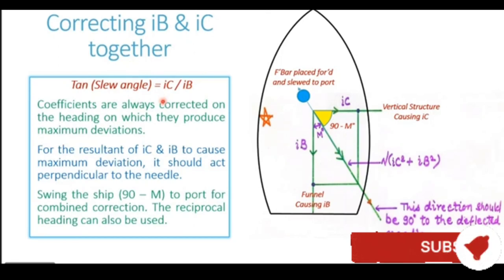the Flinders bar. Now the Flinders bar has to be placed in a direction which is opposite to the resultant of these two forces. So opposite to the resultant, we place the Flinders bar somewhere here in this direction. The magnitude of the Flinders bar, or the length of the Flinders bar, is decided by the magnitude of the resultant, and the slew angle is this angle M, which we have calculated using the formula tan of slew angle is equal to IC upon IB. So is it clear, beta?